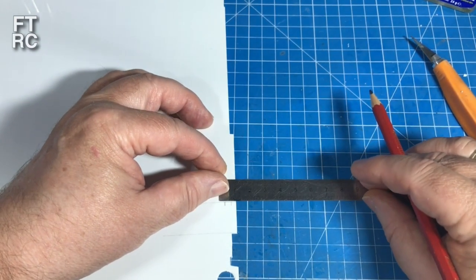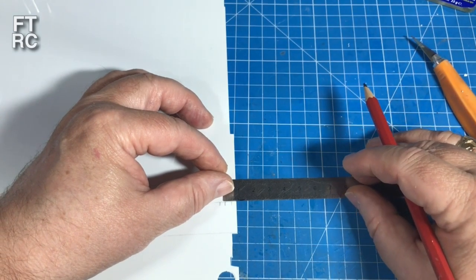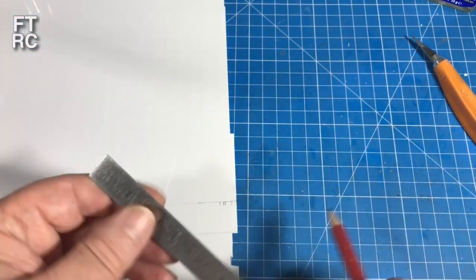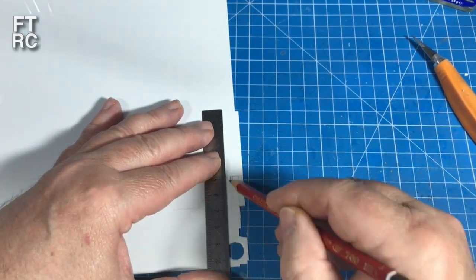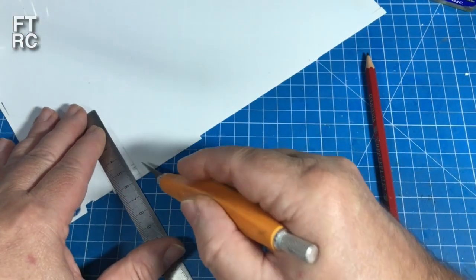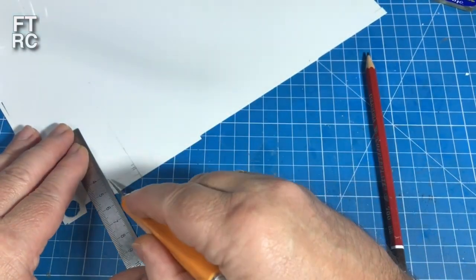And it just so happened it was a lovely Pythagorean triangle. It was basically 3 across and 4 up, so you know your hypotenuse is 5. 3, 4, 5. You ever done your maths, right? So I knew that that diagonal panel was actually going to be 5 wide. So all the other ones I could measure up fairly easily.